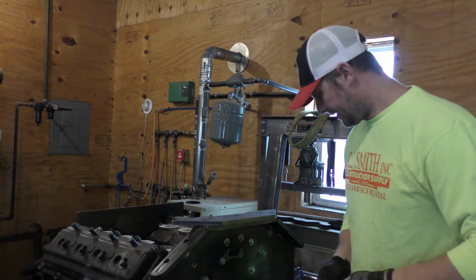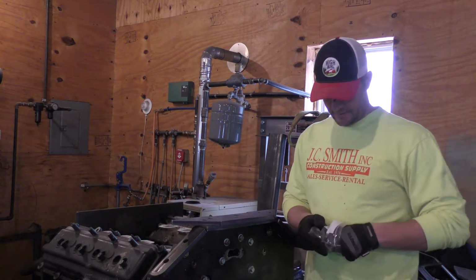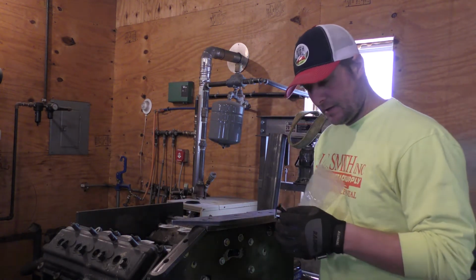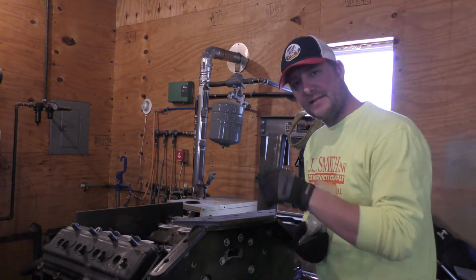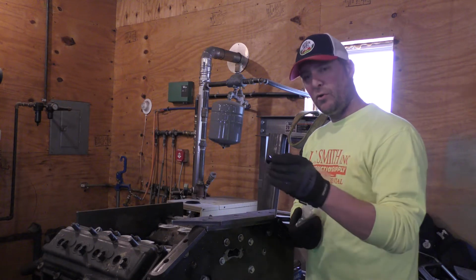So I finally got my special bolts from Fastenal. I'll show you what they look like. They're a recessed head because I can't have any head sticking out on the inside part of this because the oil pan's right there. So these will pull in flush.